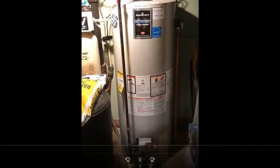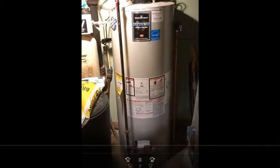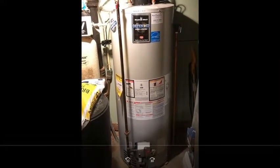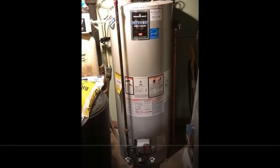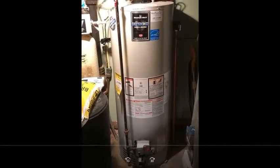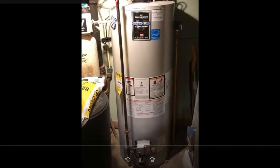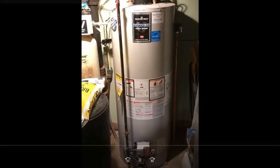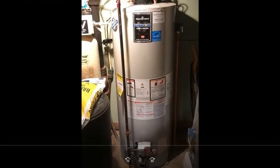When we talk about combustion safety, we're primarily concerned with the ability of a water heater, a furnace, or a combustion device to exhaust combustion byproducts up and out of the building. What we're concerned with is spillage — combustion byproducts spilling back into the living space. If that happens for more than about two minutes, it's called backdrafting.